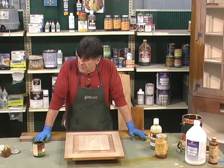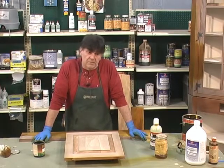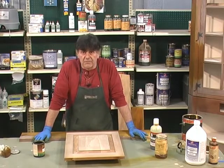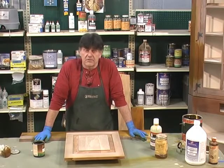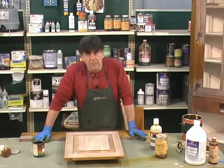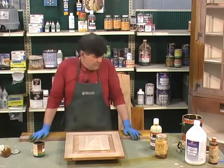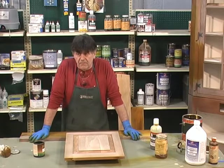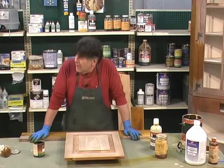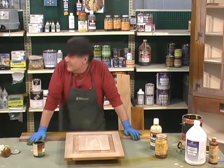So, you know, ironically, most of your cherry out there is maple. You know, they make it dark, and that's just the way they do it. If you're going dark, maple will make as pretty a cherry as you ever seen. Poplar makes a gorgeous walnut. These are just facts. Here's what they do. Remember what we said, you got to get an even background. Well, the dominant color that they use is yellow. I know you think I'd have lost my mind. Well, it's all right. You won't be the first.